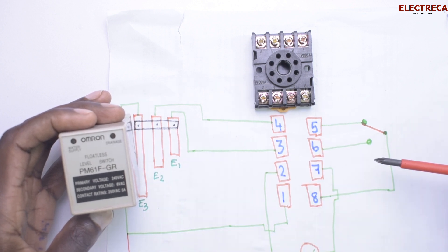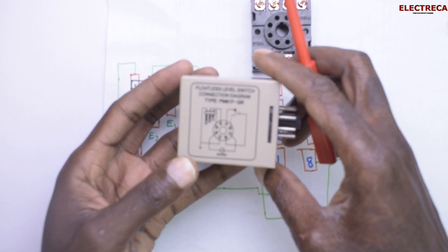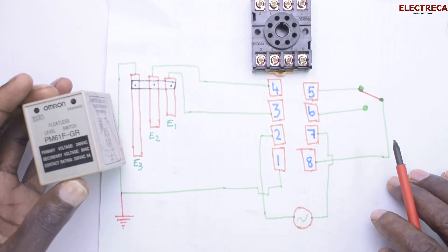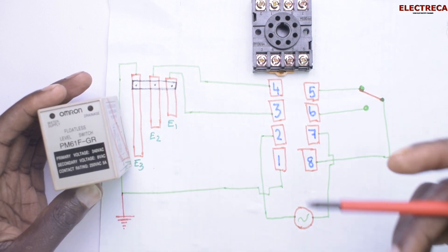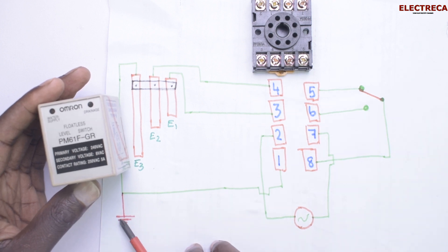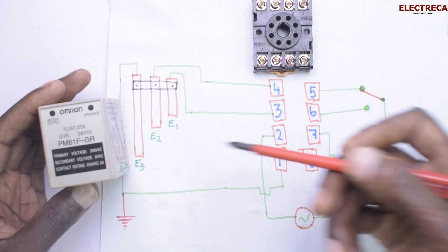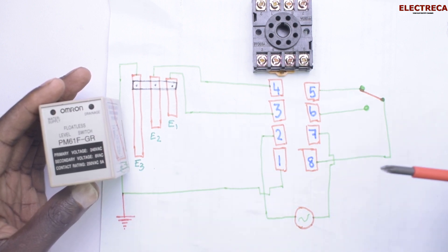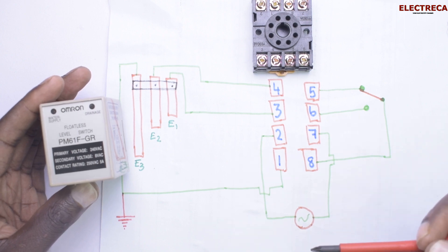You also have to note the grounding. If you look at the drawing, there is a ground — E1 and E3 are grounded. The reason they do that is because there is some leakage. Someone said this is direct current and you could be electrocuted — and it's true, you could be — but that's why it must be earthed. Not all 240V is directly linked to these electrodes; it is a very small voltage. We still earth it so we remove all residual current and you are safe. Otherwise, if it was full 240V in there, you wouldn't even be able to touch your piping, especially if you're using GI pipe.